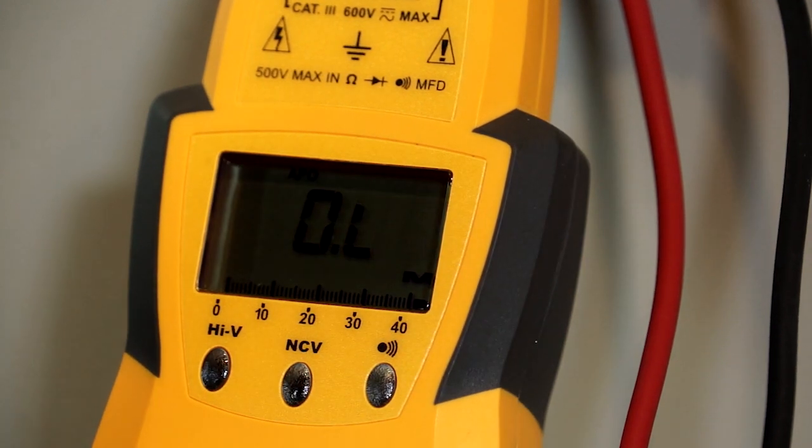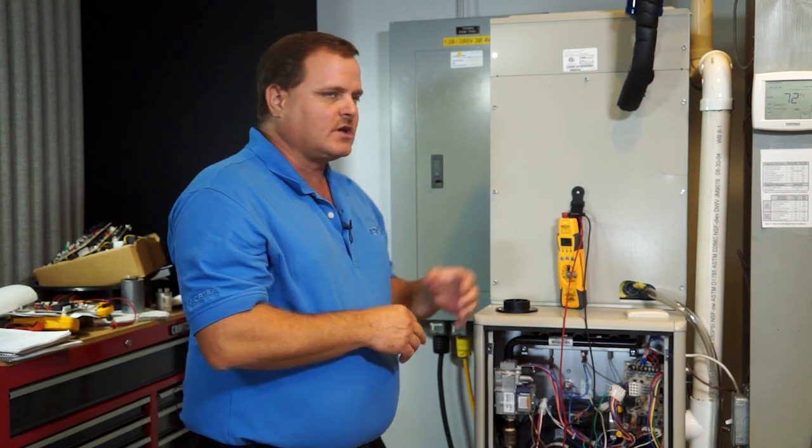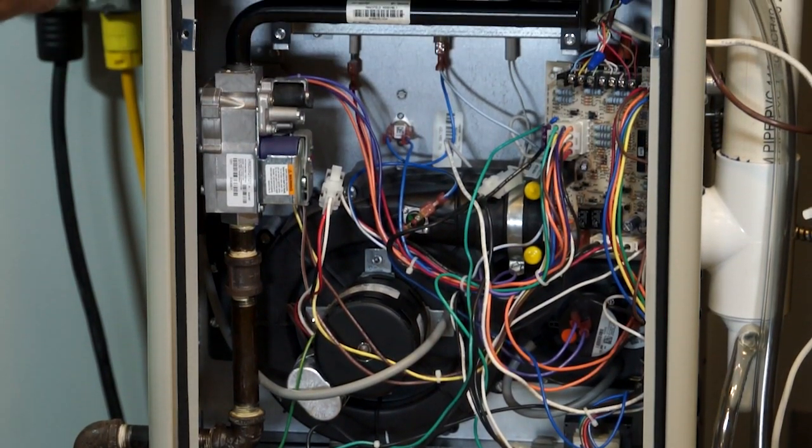In the switching circuit, you really should have close to zero ohms. If you have five limits in series, such as you would have on this furnace, you may get a little resistance — you might get two ohms, 2.5 ohms, it might even be only 1.5 ohms. But you definitely shouldn't have 50 ohms of resistance when the wire just goes from the blower compartment through five limits and up to this board.